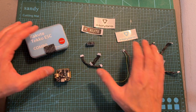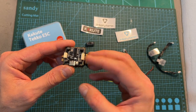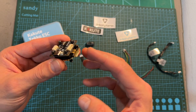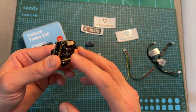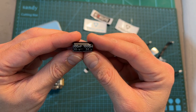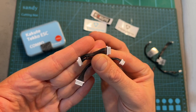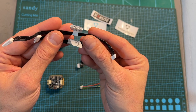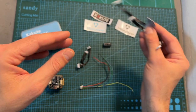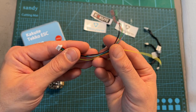In terms of packaging, here you can see everything that came inside the box. Along with the stack, which is based on an F7 flight controller and a 45 or 50 amp BLHeli32 4-in-1 ESC depending on the version, you get four M2 screws and nuts, rubber grommets, some stickers, a 35V 1000 microfarad capacitor, two harnesses in different lengths for connecting the 4-in-1 ESC to the flight controller, nine and 15 centimeter harnesses for connecting the flight controller to the DJI air unit, and another 15 centimeter harness for other types of video transmitters.